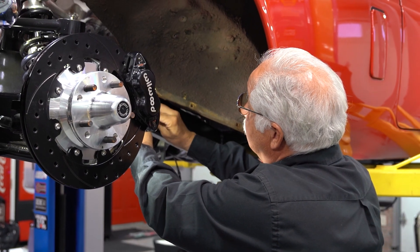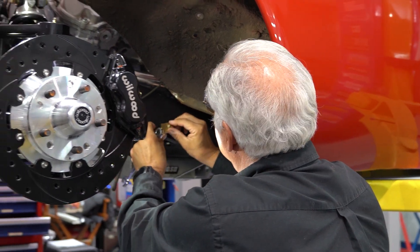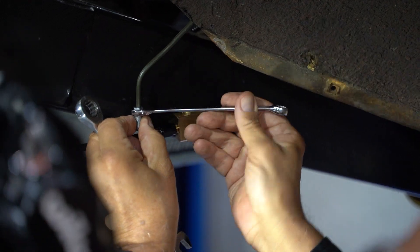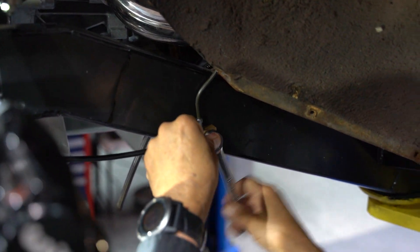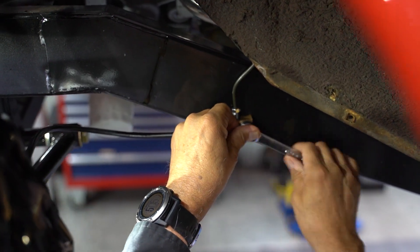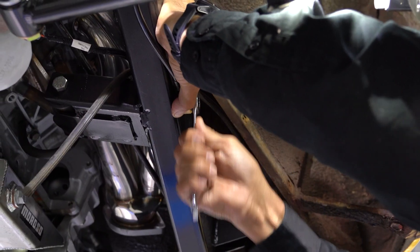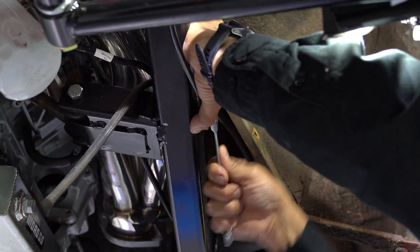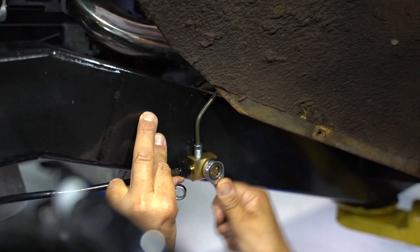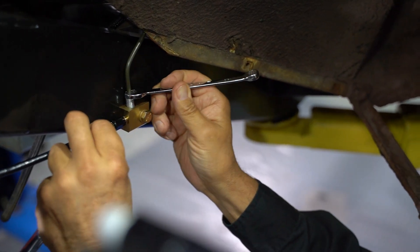What we've got here is a little manifold block. We transfer punched a hole, drilled and tapped it. You want to make sure the manifold block is loose because we're going to run the line we just made. It's really important when doing these things — leave everything loose so you can get in with your wrenches. Make sure you don't have a really tight bend, because you need clearance to tighten everything up. When you put it together, don't make your spaces too tight.